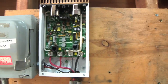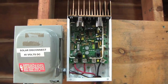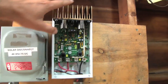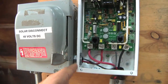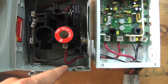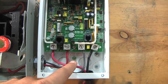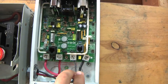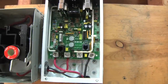Right here is the solar charge controller — this is something I already had. I took a big board and screwed down both the disconnect and the charge controller to it, and put a little connector between the two for the power to pass through. You can see at the bottom the black and red wires connect through into here. It was real easy to wire — all I had to do was follow the diagram that came with the charge controller. Your two red wires and your two black wires: two are from the solar panel and two go to the batteries.